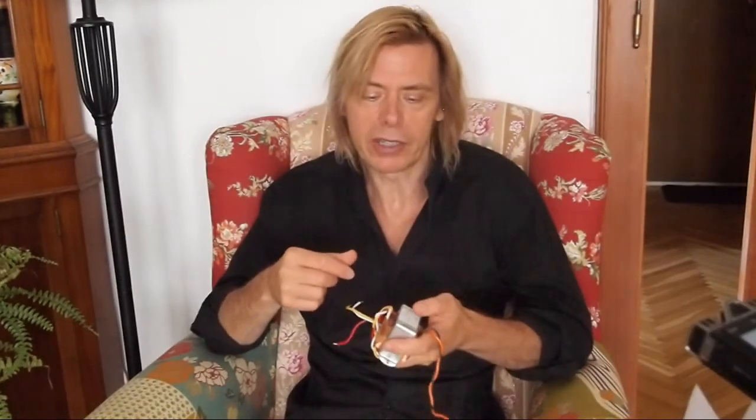The output transformer is like a fluid-coupled transmission because there's no direct electrical connection between primary and secondary — it's electromagnetically coupled, so really fast changes on one aren't seen by the other. That's the high-frequency response roll-off we talked about. Also, you can't put an infinite amount of power through an output transformer. The core gets saturated and can no longer efficiently transfer power from primary to secondary; the excess power turns into heat, and if there's too much heat, the thing just burns up.